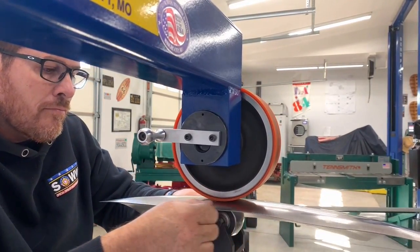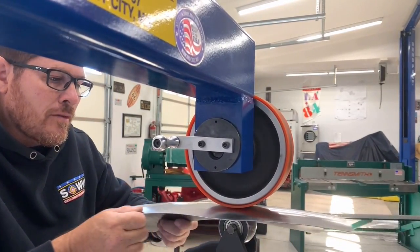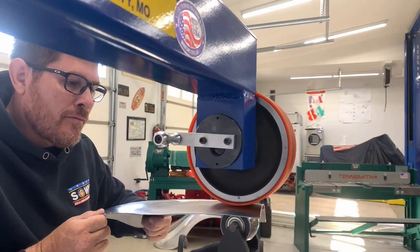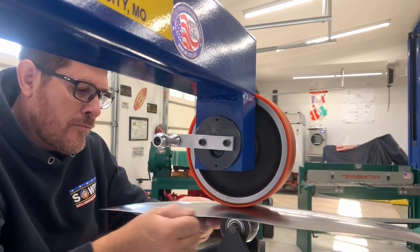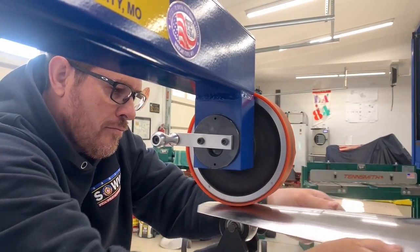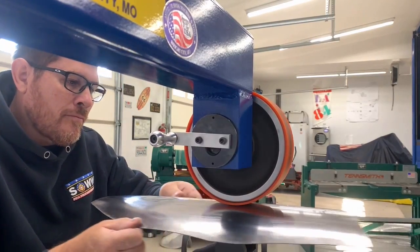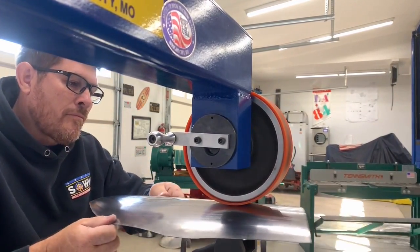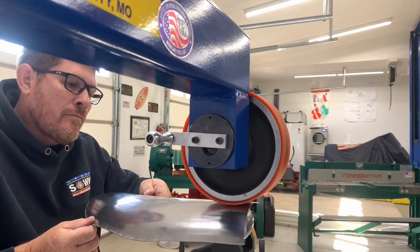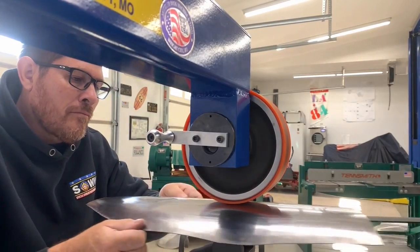What I love about the wheel is it's so mellow, whereas using a power hammer and planishing hammers you need your earplugs in and there's constant vibration going through your arms. It's very zen. Very zen, is it? Yeah, you're getting your rhythm down now. It's not a race. And that's what it's all about, the English wheel, becoming one with a machine, so that the rhythm and the whole consistency of it is flowing. Otherwise you're jumping around, stop and start all over the place, and you're really not getting a consistent line and flow.